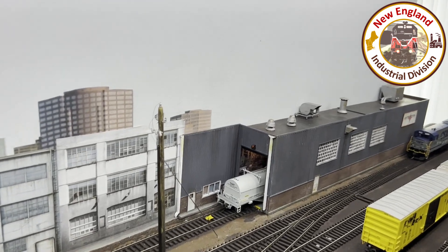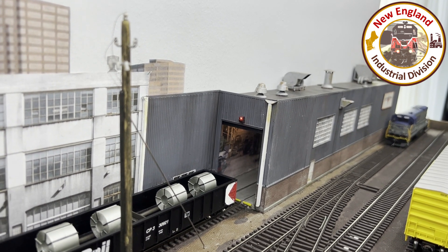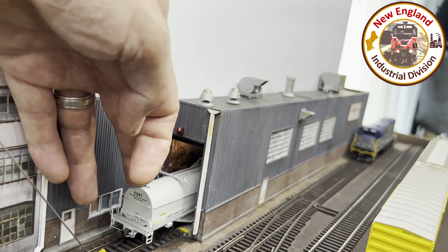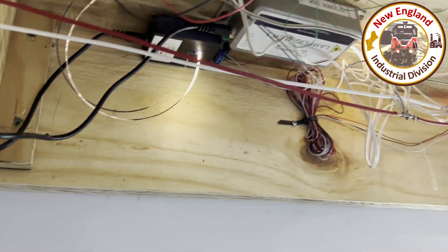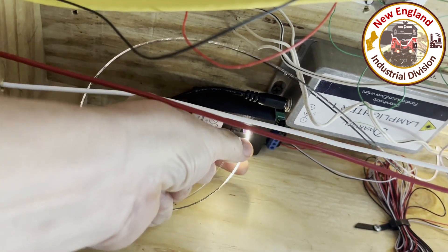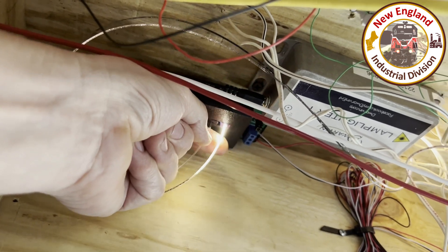Where it worked for me on this layout is over here at the manufacturing plant facility. If the cars are out of there, there's a time delay for it to go to green. It goes to green, and as you're backing in you'll know when you're in far enough so you don't hit the back wall - it gives you a little more room. It'll turn red because it's covering up that Iowa Scaled Engineering infrared sensor. This is the box that I had in my hand - you can see there's an LED that drives the fiber optic for the red, which is on now, and one for the green. When you uncover that infrared detector, it'll go from red to green.